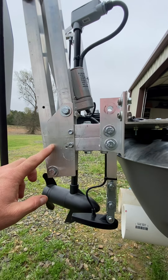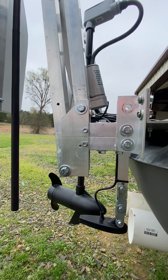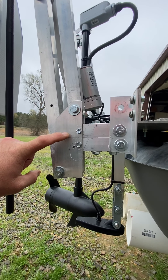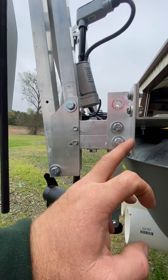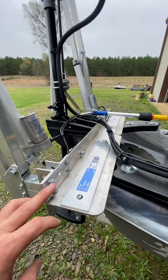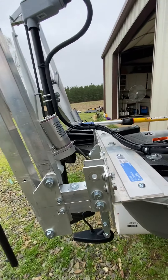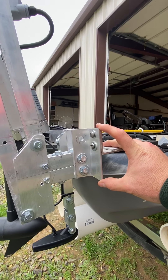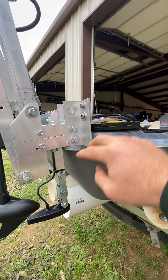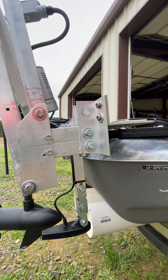Another key factor I found was another piece of aluminum — this is two inches wide, and I bought a 36-inch piece which was plenty. So if you go out, buy one eight-foot square tubing, one 36-inch piece of two-inch width aluminum, an inch-and-a-half angle iron, and another piece of two-inch to help sturdy it up. Starting right here, this section is roughly about three inches in length, bolted to the angle iron, and I made some down runners using two pieces of one-inch square tubing.